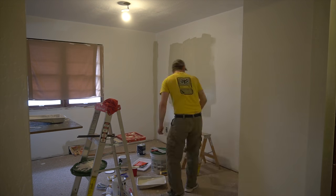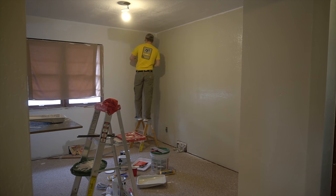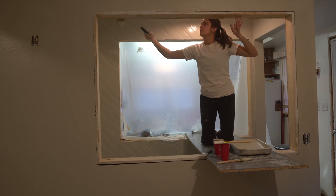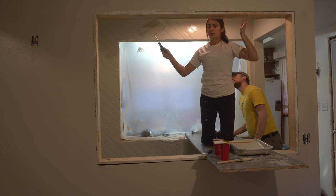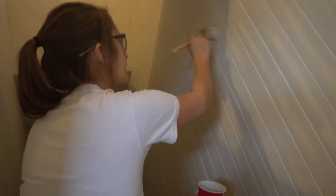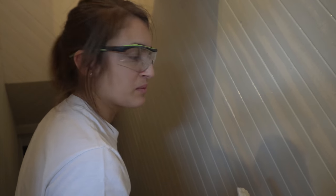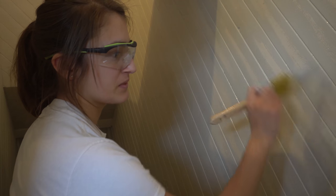When it comes to painting, I don't have the skill or patience to do the detail work, but Katie excels at it. So while she cuts into all the tight corners and places that transition from one color to another, I just slop paint onto the biggest surfaces with a roller. We decided not to remove the paneling in the stairway and instead just painted over it. We used a big sheet of plywood between the two window frames as makeshift scaffolding to reach the highest parts. It took two coats of primer to cover up the paneling. We'll need two coats of actual paint on the walls just because of the texture.